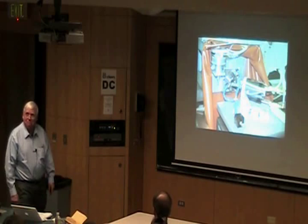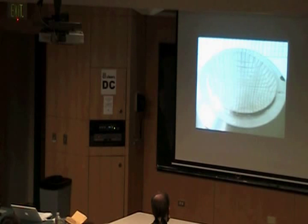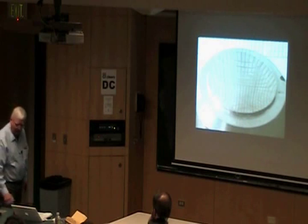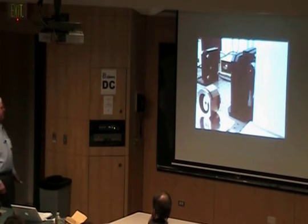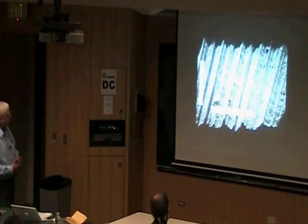It worked pretty well, didn't it? So, anyway, this is a part. Again, it's the Spectra focusing lens done this way. What's interesting about this one was it wasn't polished. That's a ground surface. Nobody would ever let me put one in the mold without polishing, even though it would have worked fine, because the grind still isn't cosmetically what it ought to be. If you shine just a laser beam onto that ground part, you get a lot of spots. It thinks it's a diffraction grating because the error is reasonably periodic from all the passes that were made. But it's very shallow. The results are quite good.